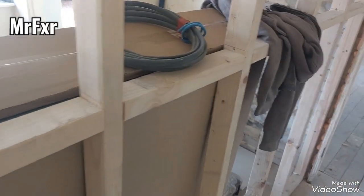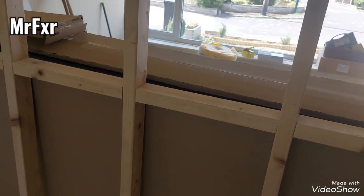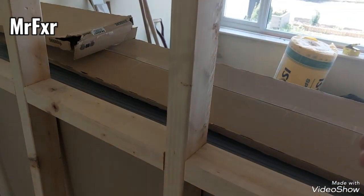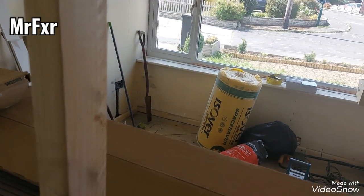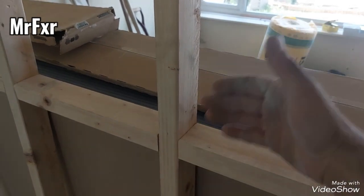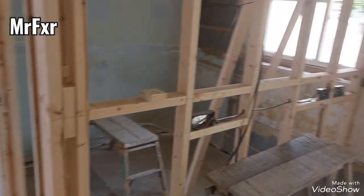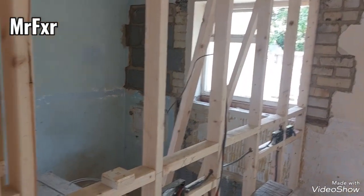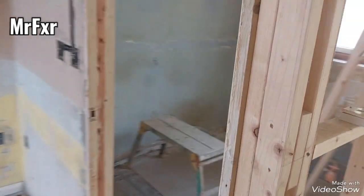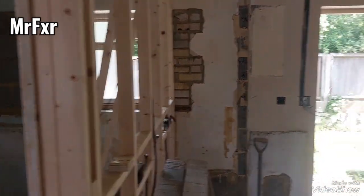It actually stops the sound before it starts entering the wall cavity. I will put insulation in there as well, quilt I got there. So I'm going to have soundboard on both sides, and insulation in between, on this wall of the bedroom and on this kitchen bathroom wall as well. Just want to minimize any sound travel, especially with these thin walls. They're only 3x2 CLS.